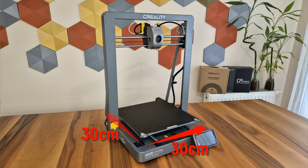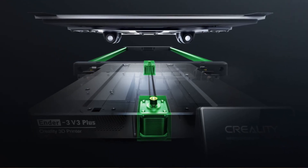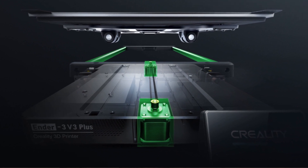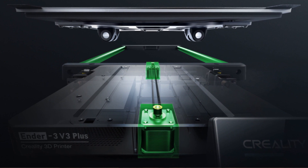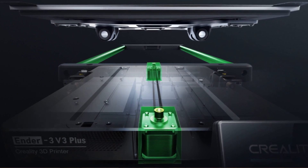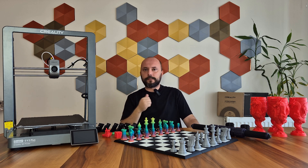That's a big difference — even bigger than the K1 Max. With the Version 3 Plus, prints with a width and depth of 30x30 cm and a height of up to 33 centimeters are possible. Double Y-axis motors were used for fast movements of the large bed. This makes sense, especially for long-term printing. The motors do not heat up easily and their performance does not drop, ensuring better results even for large prints that put a load on the bed.